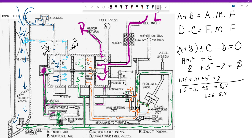I believe that covers it. We have covered every single item on this carburetor: the fuel control unit, the economizer, the accelerator pump, the idle mixture, and the ADI system. The only thing I really didn't cover is the primer here, which is electrically controlled — it just allows the pilot to hit the primer, opening this up and allowing fuel to go to the cylinders for starting. But this really doesn't have much effect on normal operation. And there you have it — that is the PR58 pressure carburetor.